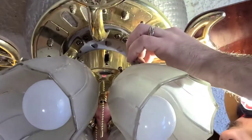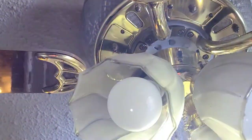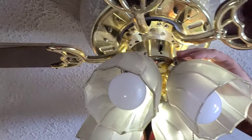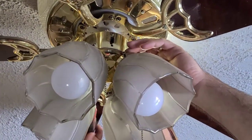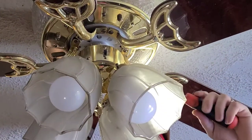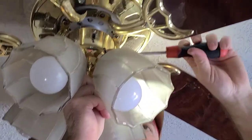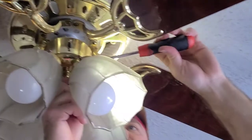You'll say you were going to replace the fan one, and you had your fan turned off, but it would still be getting power — and zip, zip, zip. What just happened? I thought he had it turned off. You always check your stuff. Your best bet is after you turn it off, use that voltage tester before you touch it. That's why I did that. If your fan's off and the switch is broke, make sure you use that wiring tester before you touch it.